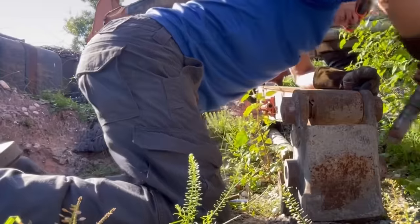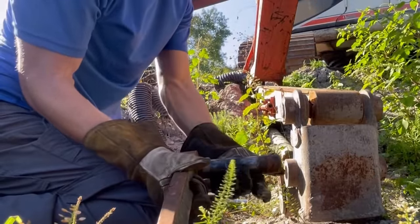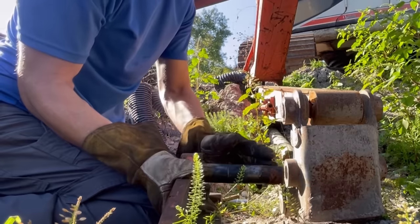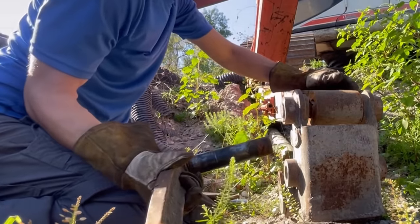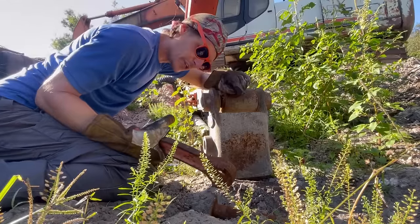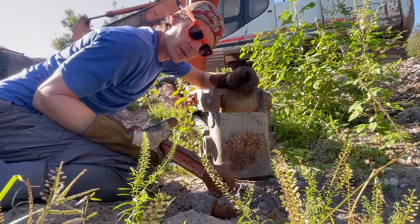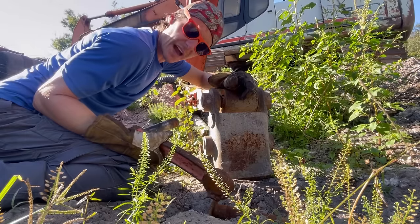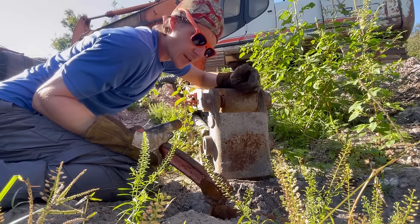This pin isn't bad honestly — not great. You can see we got a little bit of wallowing in there, a little bit of a high spot. It's not awful — we might reuse that pin versus the other one depending on which is better. We did get two new pins and two new bushings for the machine, but he didn't want to splurge and do all of them because it would have been two to three thousand dollars on a six thousand dollar machine — and can you really blame him?